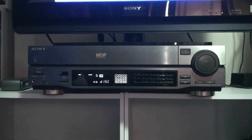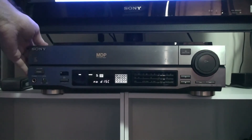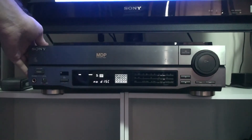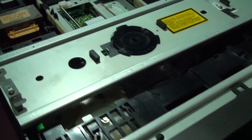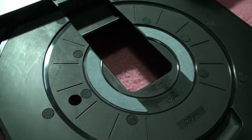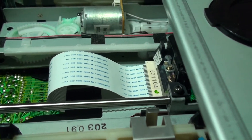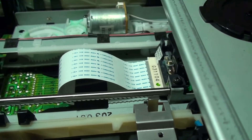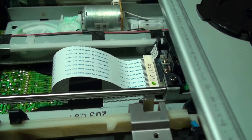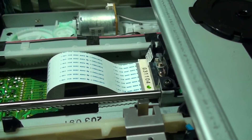So I'm going to have to pull this apart and have a look. See what laser model it is and see if it's healthy or not, give it a few adjustments. It's much easier to access the laser if you eject the disc tray and switch the machine off - that exposes the laser. I've done a few things to it and it's obviously a dead laser. So I'm going to have to order a new one if possible - the KHS-130A.